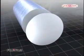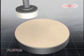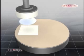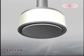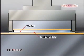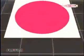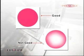The next application is a measurement of a silicon wafer surface polishing pressure. Place a Prescale that is slightly bigger than the wafer on the rotating level block. Place a polishing head with a mirror finish surface wafer on the block and keep pressing it with an even force for a few seconds. Then, separate the polishing head from the rotating level block and check the color development on the Prescale. If the wafer surface is flat and smooth and the device has good balance, the color will develop evenly. If the wafer thickness is uneven or the device has unbalanced pressure, the color will develop unevenly.